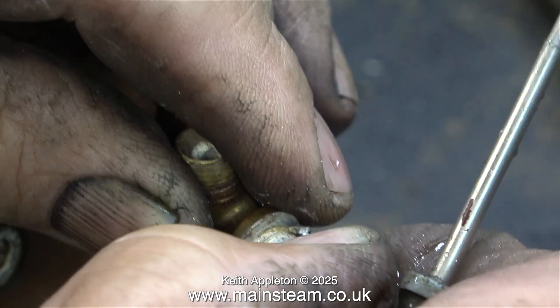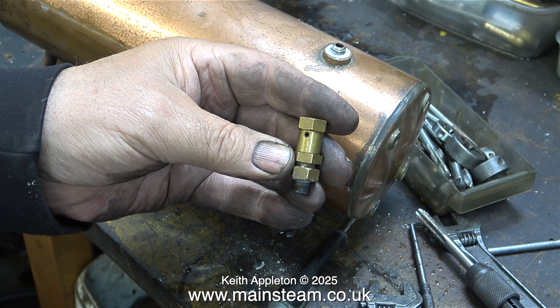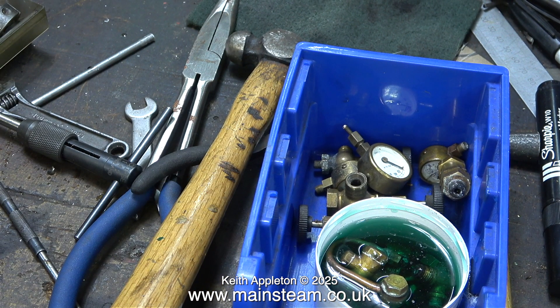The fitting is a mess, and once again — not wishing to go on about it too much — try not to use aluminium washers on fittings that go into steam boilers. On this 504 boiler, the safety valve is in quite good condition. Not much corrosion — surprise, surprise. I won't put that in the acid; I'll just put it in the box.